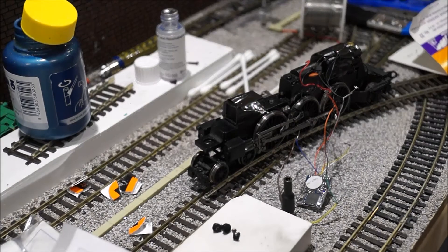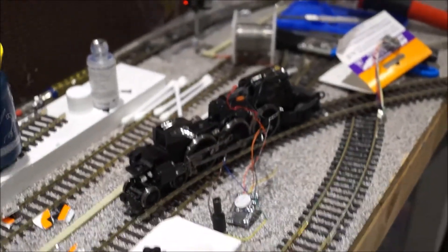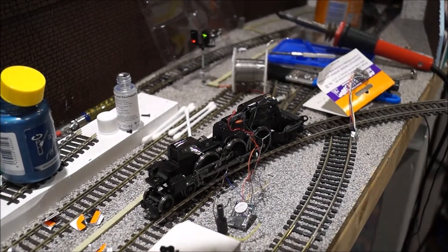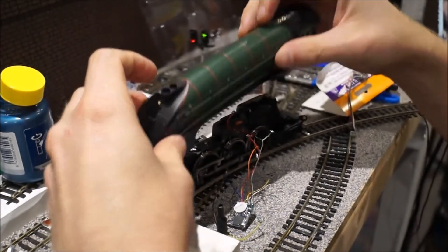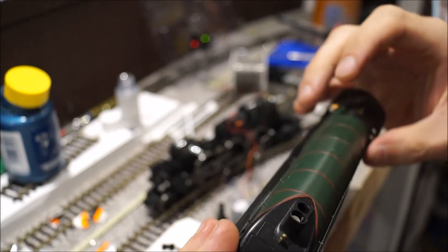As you can see, I press function 1 and it starts up how it should be. I press function 1 again and it turns off — with the other decoder that wasn't happening. I wired the yellow one to the green and the brown to the blue on the decoder. I ended up taking the board away, cutting it, and putting the orange to the motor, the grey to the motor, the red to the positive, and the black to the negative — wired like you normally do when you don't have a board. It's all done, it works, it looks great. I'm now just going to put the locomotive back together.